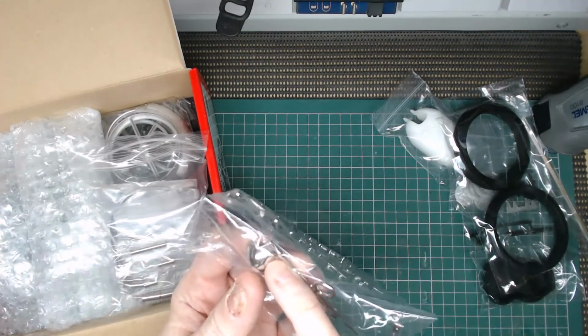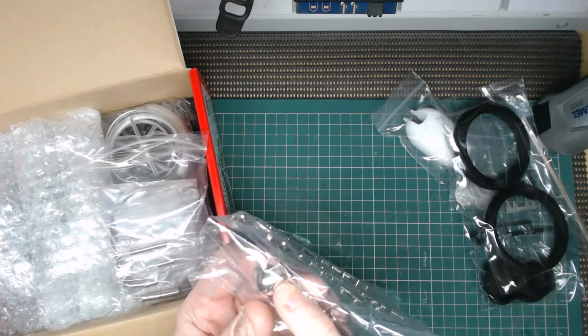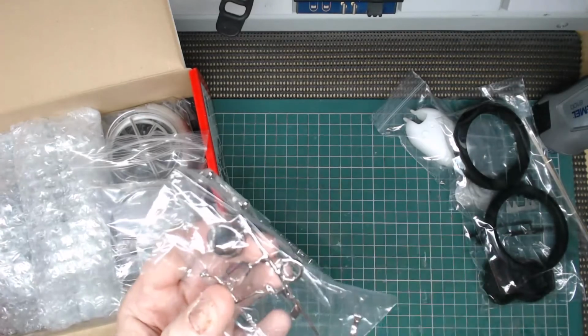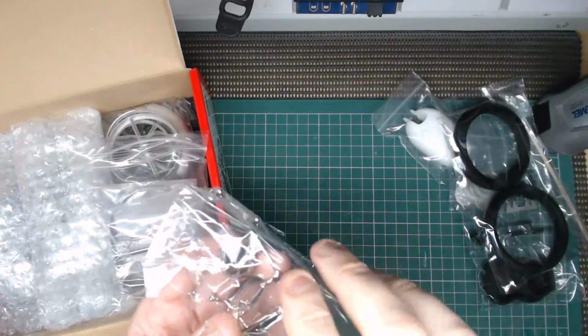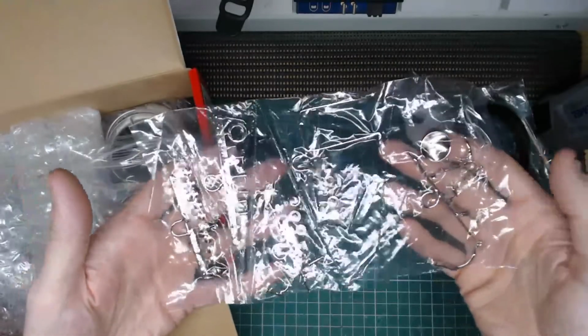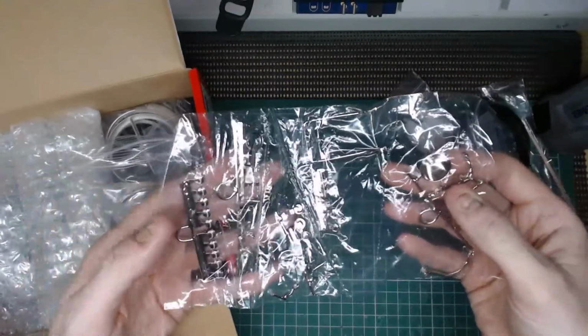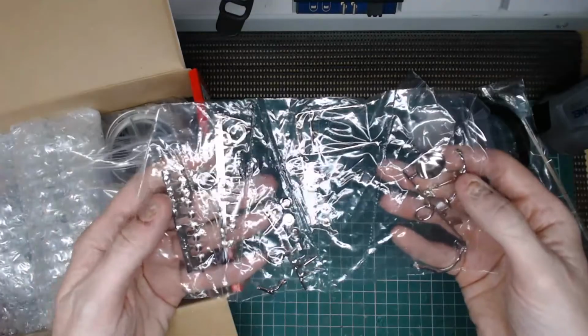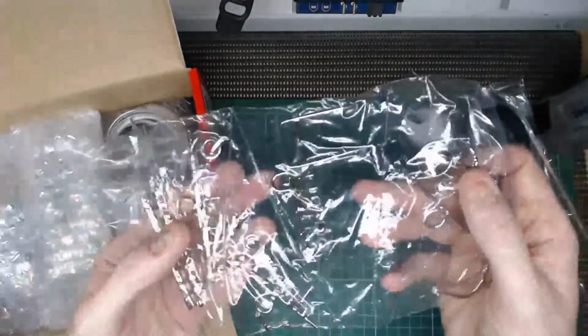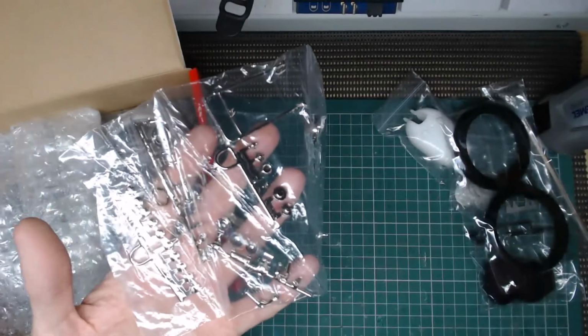Where they attach, you will always get a little bit that's not going to be chromed, and you cannot replicate this chroming. You can't buy a paint, you can't re-chrome it, so you have to be extremely careful how you cut these pieces off and how much filing you do, because you don't want to damage the chroming, because you can't replace it.